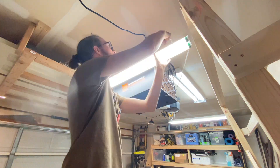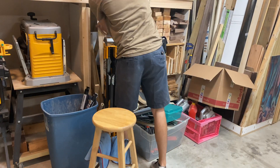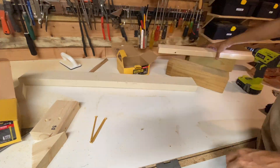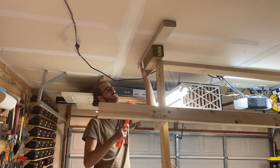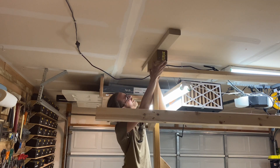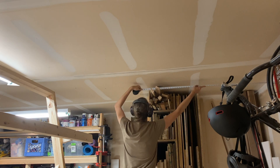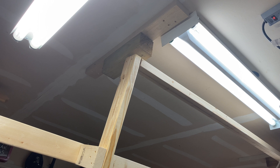I added a little bit longer chains so that my light would hang just a little bit lower and wouldn't hit the frame. My frame was five inches from the ceiling, so luckily just grabbing a 2x4 and a scrap 4x4 block and putting them together gave me the perfect distance for attaching my hinges to the ceiling and into the frame. Getting the right measurements to make sure that the ceiling mount was parallel to the wall was a little bit difficult, but I finally figured it out. I thought I filmed myself attaching the 2x4s to the ceiling, but I didn't — it's just two screws on either side, and now it's attached to the ceiling.